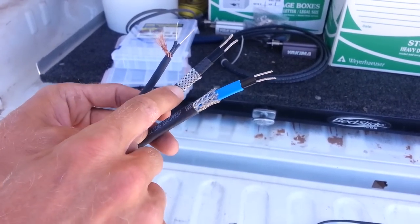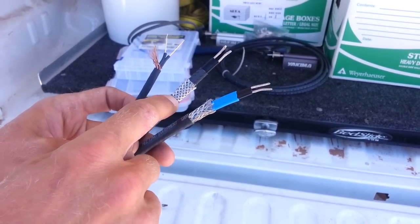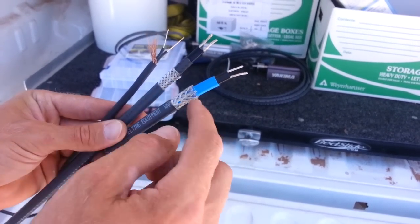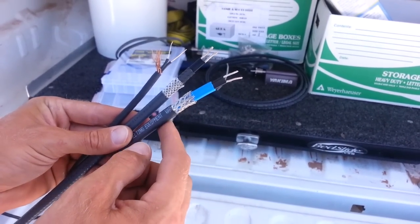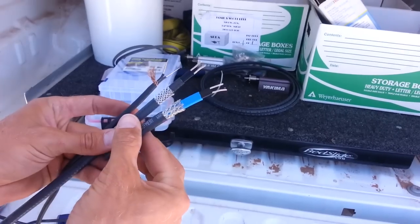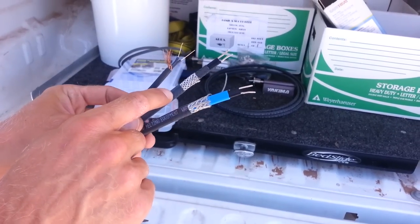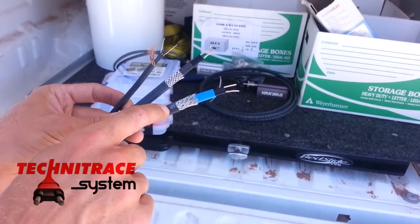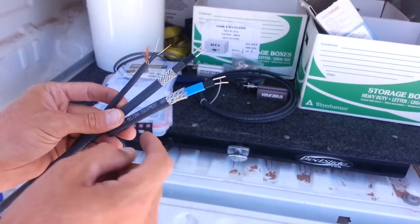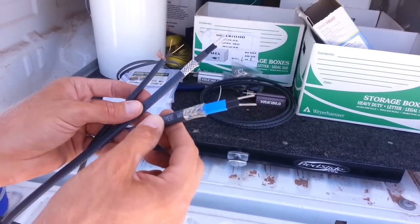It's about the size of a coax cable. This one here is a self-regulating heat tape, considered commercial — light commercial residential heat tape. This other one is also a self-regulating heat tape. Comparing these two, you'll see this one has a blue coating inside, which is an indicator that it's a 120-volt heat tape, not a 240-volt. These two are actually about identical in performance, heat output — they function the same way. This one is a little bit thicker. In my own personal opinion, this one — called Technotrace — has a slight advantage. This other one is Raychem. Technotrace, in my opinion, has a harder outer coating, a Teflon jacket. It's more durable. I've found the Raychem gets beat up easily and opens up with gashes and abrasions, while the Technotrace holds up a little bit better, from my experience.